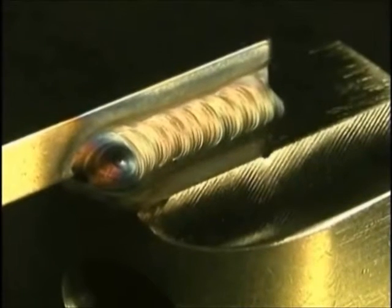This is what I hate. This is 3 or 4 pulses a second. This makes me want to quit welding right here. This is not good. This takes the fun out. It's hard to focus on. You can't figure out when to dip the rod, and the puddle freezes, makes a freeze line, and that has more to do with it than the pulse.